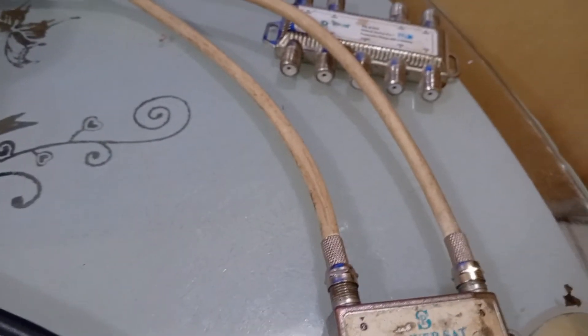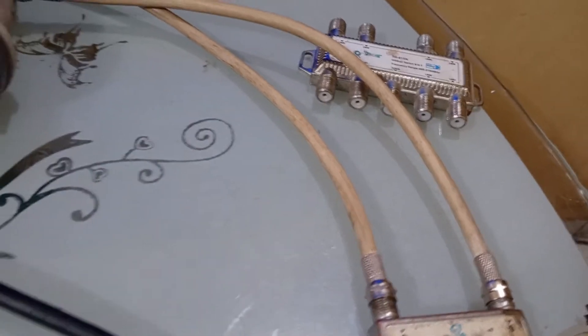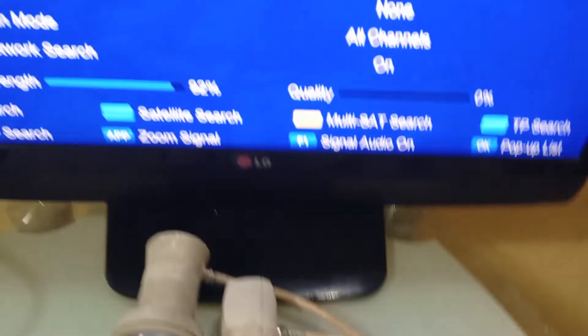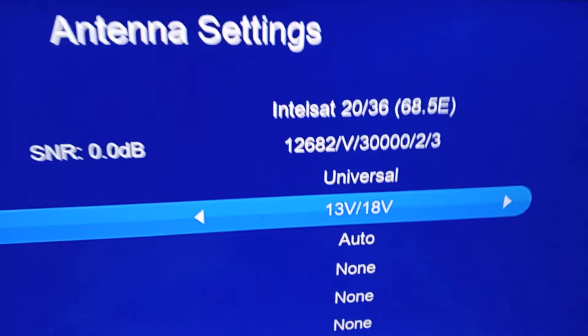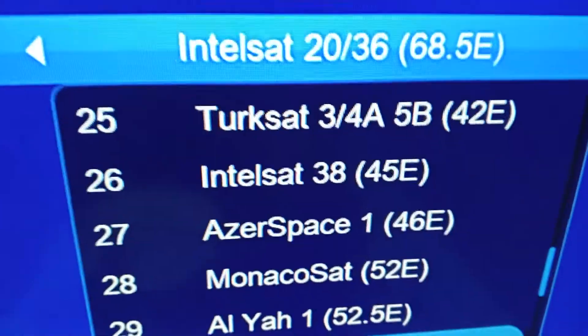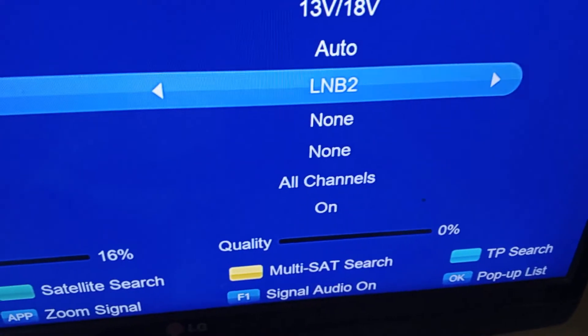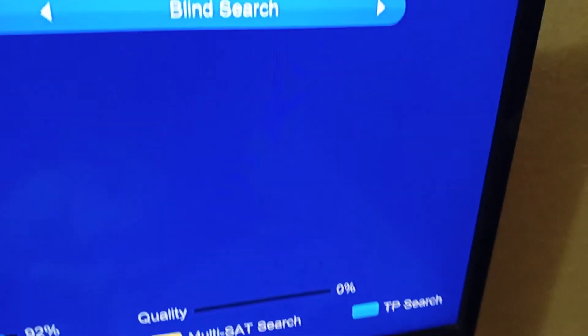Click exit, go back to Antenna Settings. This next LNBF is on port three. Let's say we're tracking Astra 28E with this LNBF. Search for Astra 28E in your satellite list, then under DiSEqC 1.0 choose port three. Scroll down to the bottom, start your search, and the satellite channels will start appearing. Click exit again when done.